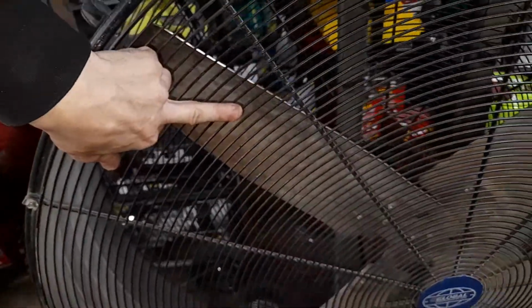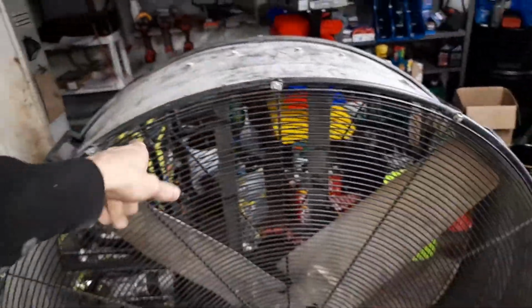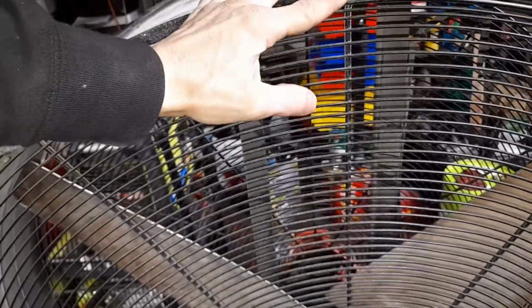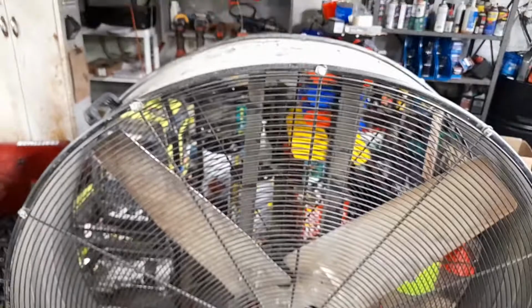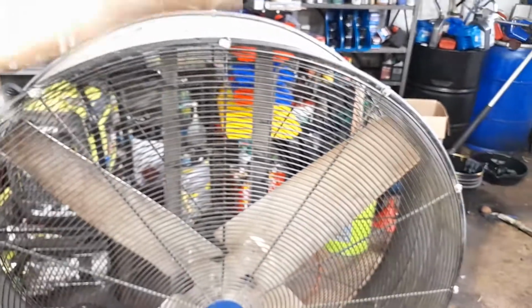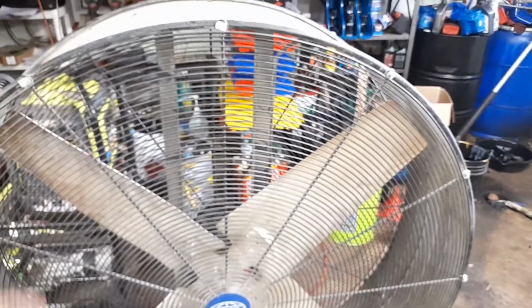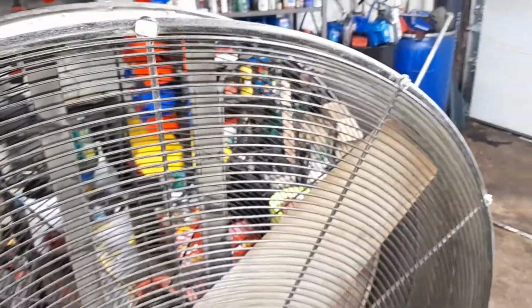So the only other thing she asked me to do here is this fan blade here is bent. So I'm going to go ahead and take this screen off, which looks to be, I don't know, 8mm bolts or Phillips head driver, something of that nature. Pull them bolts out, we'll bend that back, rewire or reconnect them and make sure it's all done appropriately. We clean the connections, do silicone electric grease to accomplish that.